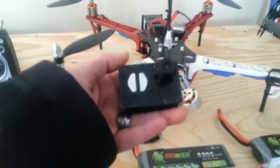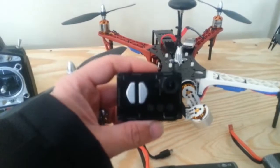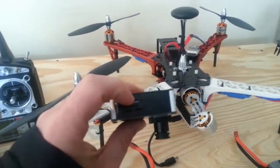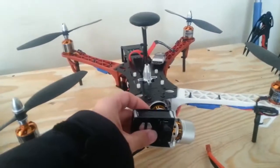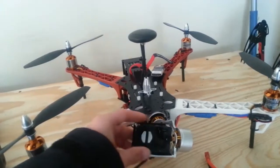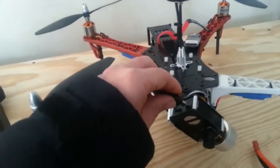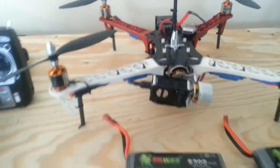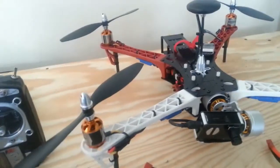I'll start with this camera. This is a Mobius camera — you may have seen them, but they usually don't look like this. I took a regular Mobius camera and put it in one of these Mobius camera boxes so that it would fit on a regular gimbal. You can see that's where the card goes in. It's got a video output that plugs into the side, and any video you shoot when the camera's on goes through the chipset in the back to overlay the telemetry.